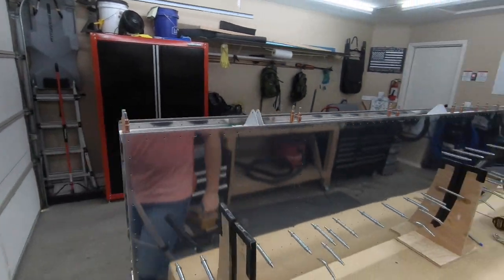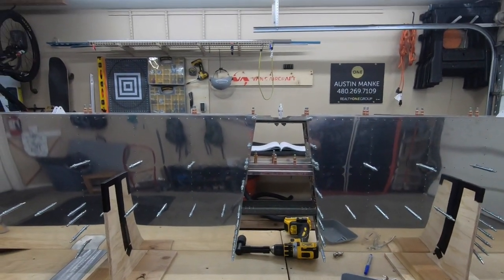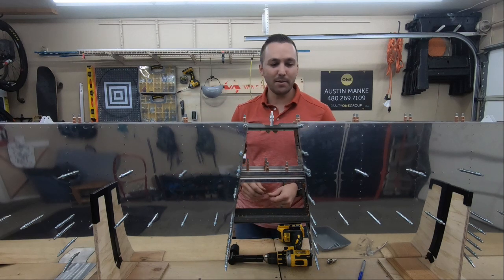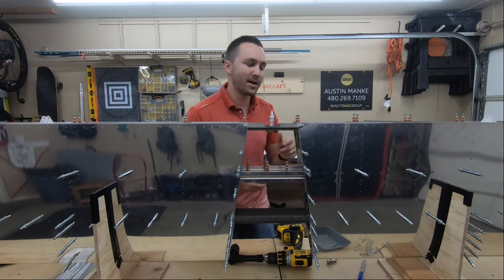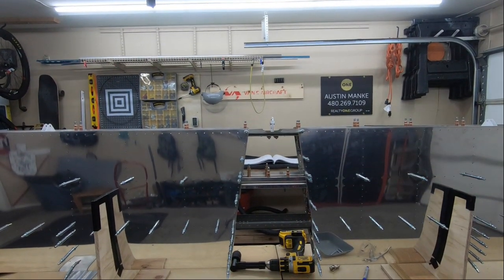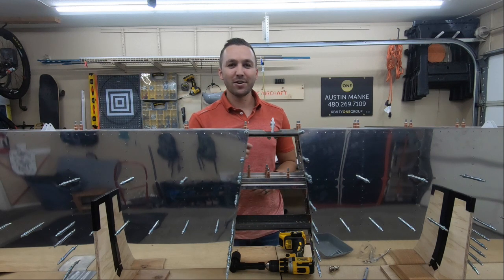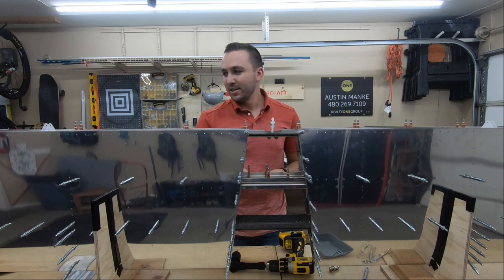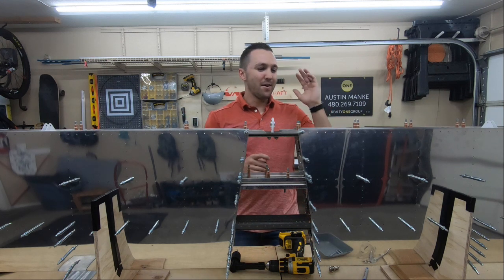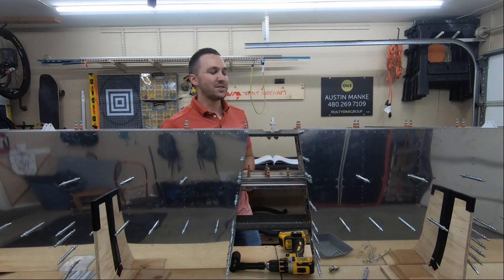As far as the final size holes go, it's kind of interesting. This year Vans made a change with their kits, at least with this RV-10, where all of the parts are going to start coming final size. Final size doesn't mean match-drilled, but there's a certain step in the process that involves getting these skins all put on and then bringing all of them up to final size. They used to come just a hair under that number 40 drill bit size, and now they actually come true to size. So what makes it interesting is all the instructions still remain the same: put all the parts together, cleco everything together, final size everything, remove all the parts, prime, dimple.